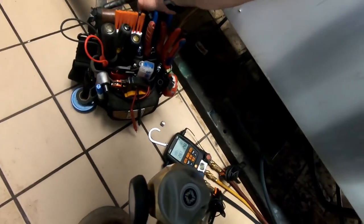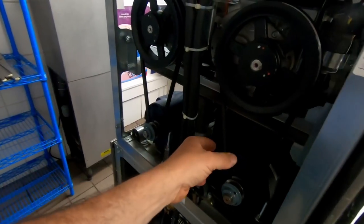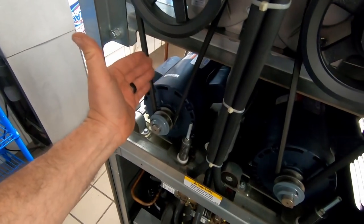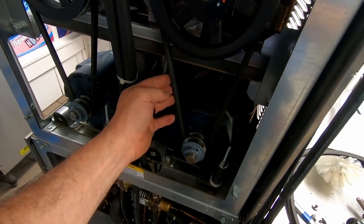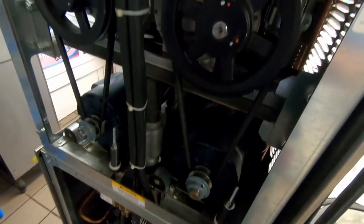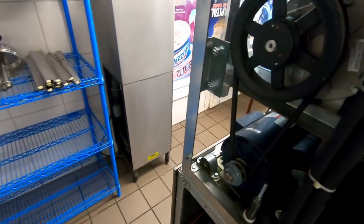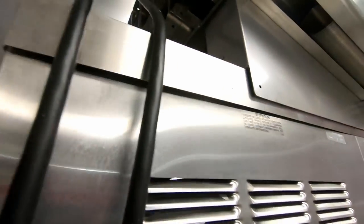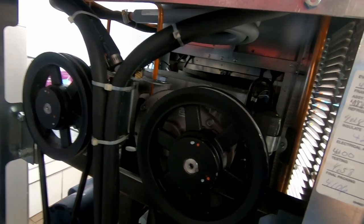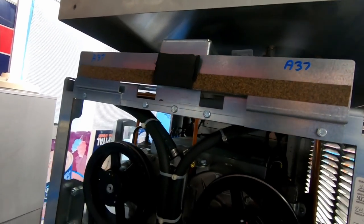Let's go check out the ice cream machine and see why it's rattling so much. The belts are wearing unevenly - the rear belt is looser than the front one. Checked the tension on this auto-tensioning pulley bracket system: the front one doesn't wobble at all, but the rear one wobbles pretty good. Checked the alignment front to back and it was okay. Picked up some new Browning belts to see if that helps - it's a rattle trap because of all this stainless steel.